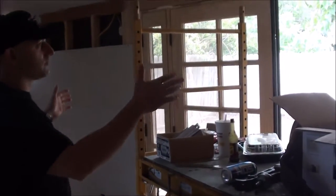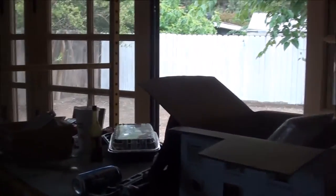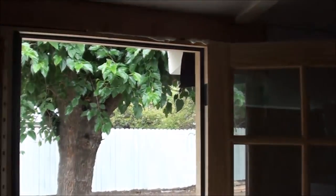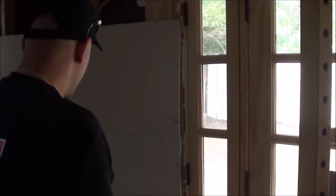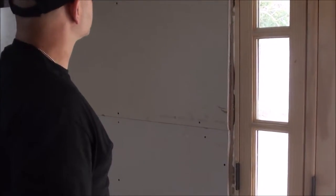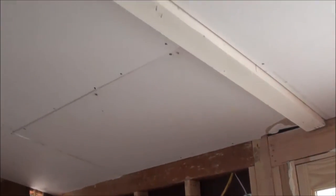You can see we put double French doors — they extend eight feet, the doors are six feet, and then we have the side panels. We also had to reframe the top of the beam; this was basically an exterior load-bearing wall with nothing here before, just a double door. We ran the lights for sconces outside on both sides. For the ceiling, we had to drop it down because it was a tongue and groove old wooden ceiling from the 1950s and the client needed sufficient lighting, so we dropped the ceiling by five inches, reframed it, and installed four-inch recess cans.